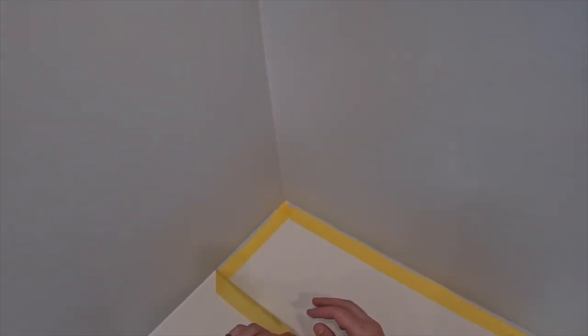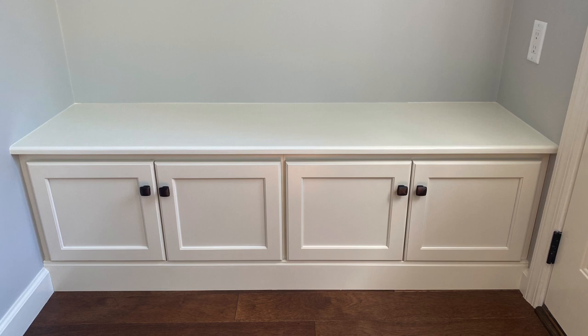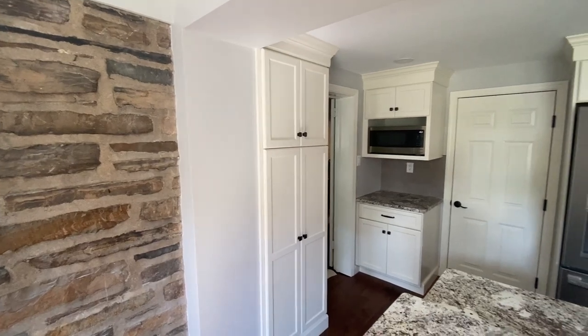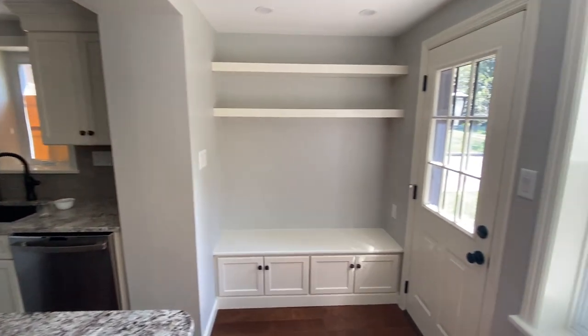We are all done with our bench and actually done with the entire kitchen — looking pretty snazzy in here. The tape pulled pretty well with a few little touch-ups. The match to the cabinets turned out really nice and all the trim looks great next to the cabinetry. If you are dealing with a raw wood sill, that is the process I would recommend: prime with your wood primer, then run your top coats. If you found this video useful, you might also like my review of Sherwin-Williams Premium Wall and Wood Primer — I'll link to that at the end. Thanks for watching, and until next time, take it easy, work smart, and have a good one.